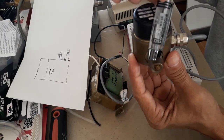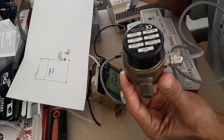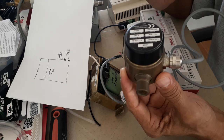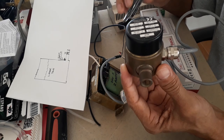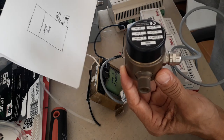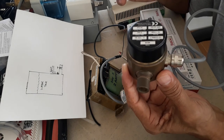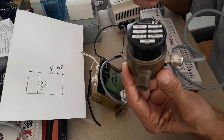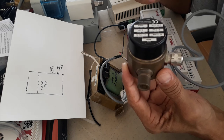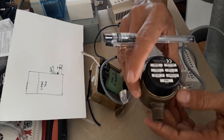For the fittings, look for the correct ones and check the pressure rating of the pipe. Make sure you follow what PN rating applies to the piping where you install the positive side of the DPT. Again, thank you for watching. This is Sandos Capilla Jr. — if you're new to my channel, please subscribe, click the notification bell, and leave a comment. God bless and bye for now.